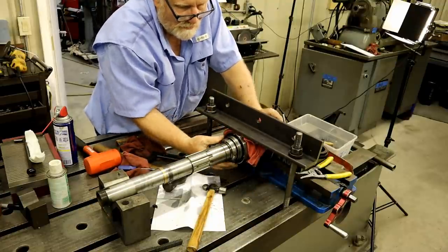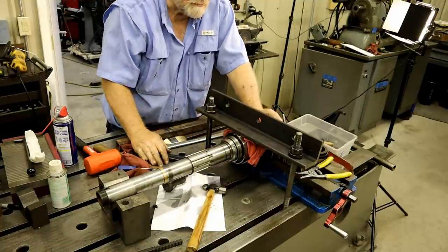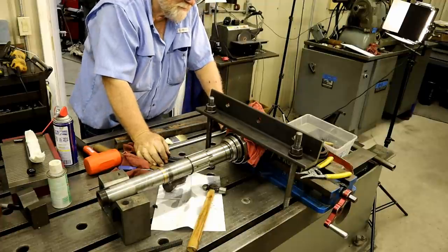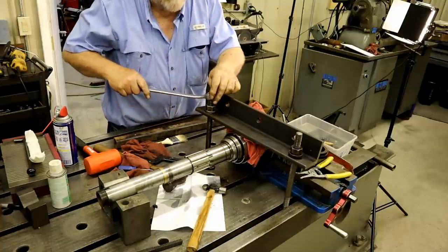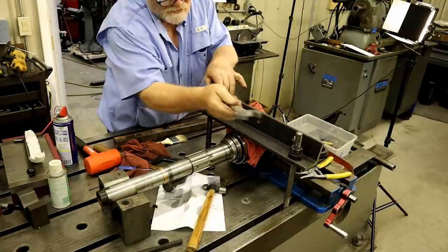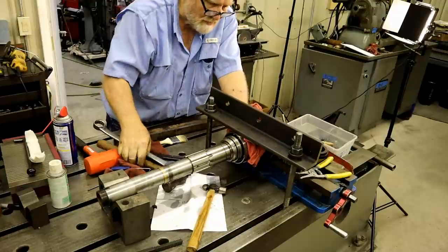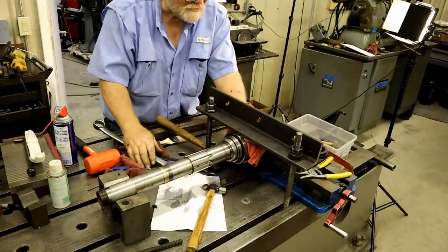You know what's coming. We have to put this thing back under pressure like it was. Is that a preload on that bearing? Those are what keeps the load on that bearing. Those collars, cylinders, whatever you want to call them, there's two of them. Yeah, behind it. There's one on the outer race, there's one on the inner race. Problem is, we got to make them both work.